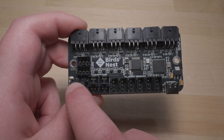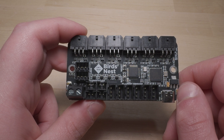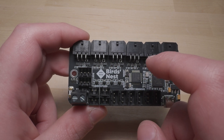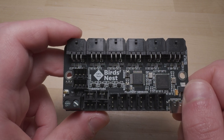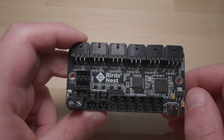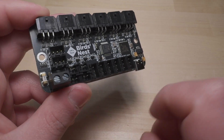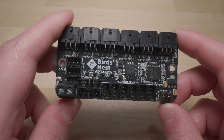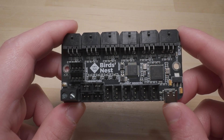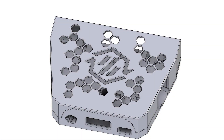The power for the USB tool head PCBs is connected through the screw terminal here, and up to 20 amps of power can be supplied to the tool heads using this PCB, which should be plenty. If you need more than 20 amps because of your hot end heaters, you should stage the initial heating — turn them on one by one. There's a 20-amp fuse here for protection, and this should be suitable for most USB tool head applications with tool changer 3D printers.